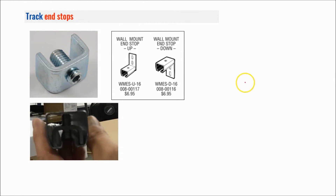At the end of the track we have the track end stops. There are two styles. You have an adjustable version — it has a set screw, it's horseshoe-shaped, and it pinches the top of the track to keep the rollers from rolling out the ends. These are nice because if you do cut your track you can put them anywhere, and they're quick to release and remove, so you could pop one out and replace your rollers. Very adjustable, very quick to install.